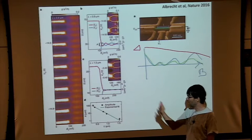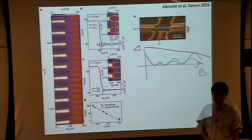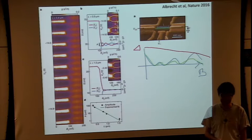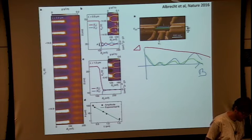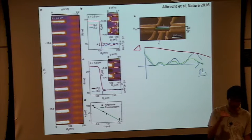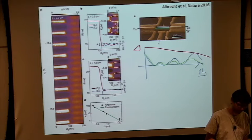Another possibility is that one of the effects is stronger, I don't know, larger G factor. You know, this is actually not my work, but I know a good person to ask. I'm not going to put him on the spot now, but if you're curious, you can talk to him after the lecture. He's in the audience, one of the authors of the paper. Okay. This is maybe a different shell thickness, so more optimized for these kind of measurements. And so definitely their superconductivity survives to higher fields in this device than in the one from the hard gap paper. Yeah. So they show data up to maybe one Tesla in this paper.